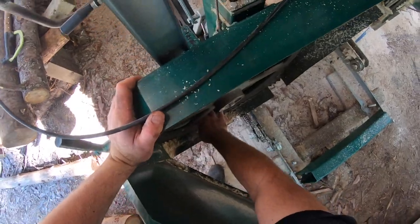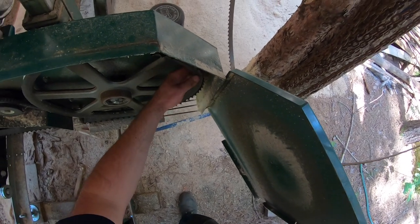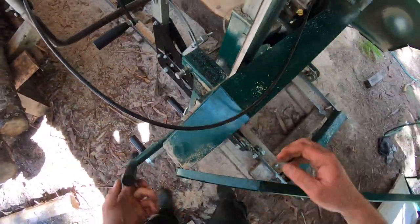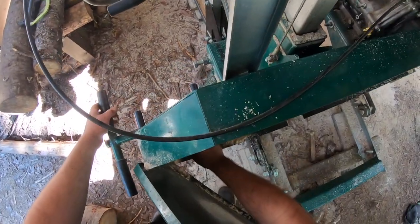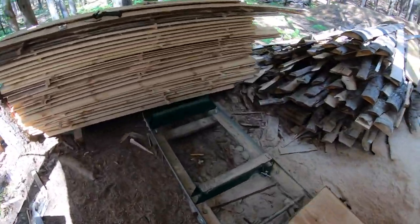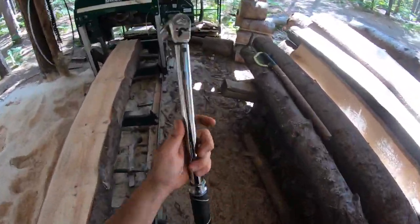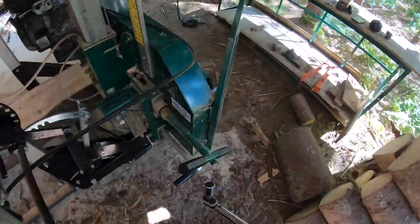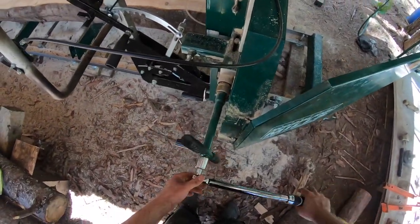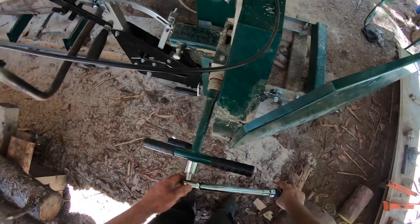Make sure we're still approximately where we should be. If not, loosen that handle off and the blade will be able to be moved again. I'm a little out of whack on the top, so let's get that fixed up. Then we'll snug it up again. I do have a torque wrench out here — you've seen it in other videos. I use this Husky one from Home Depot; it's served me quite well. Set to 25 foot-pounds according to my sawmill specs.